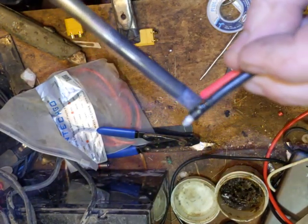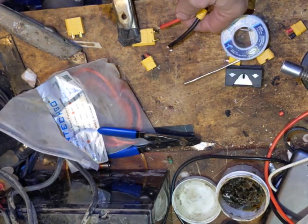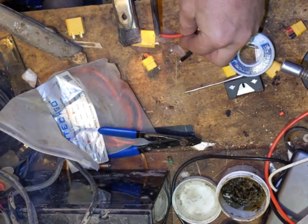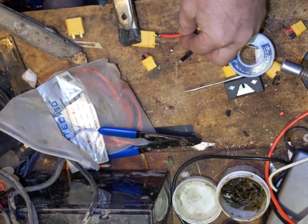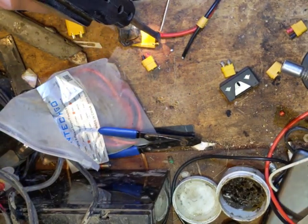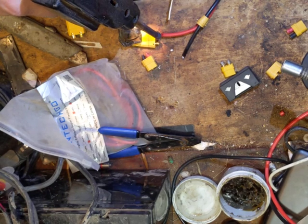Silicon will conduct heat fairly rapidly, so it'll become so hot you can't touch these things. Now that you have a pretty good amount of solder on them, observe your polarity. The raised side — see it's melting the flux that was on there — I'm just going to heat it up. Try not to heat up the plastic on the molded connector. Okay, so we sort of have things in place now.